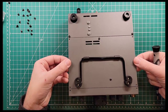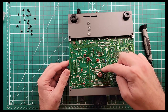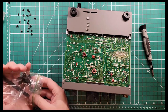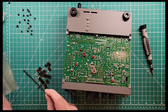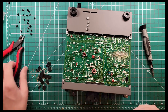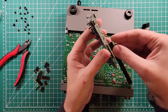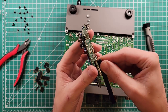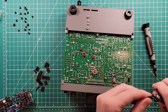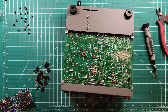There is one row of pin headers, two and three. In my collection of pin headers I might have a couple that are already cut to the right size. Pin headers usually come in a bar format and you chew away with your cutters to get to the right size. But before I chew away anything, I'm going to make sure they actually do the thing. That's a nice positive connection — I like that. It's important how pin headers feel.